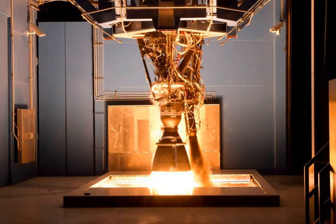The turbopump also provides high-pressure fluid for the hydraulic actuators, which then recycles into the low-pressure inlet. This eliminates the need for a separate hydraulic drive system and means that thrust vectoring control failure by running out of hydraulic fluid is not possible.